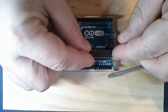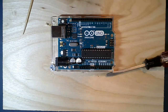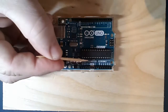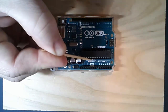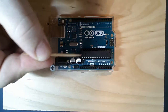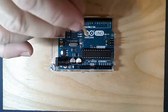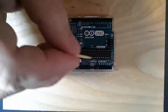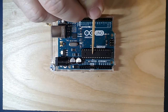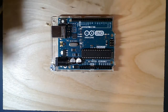Make sure power's off, line up the pins - there are tools that help you insert the chip - then push it in until it's seated. That's why we want the one with a DIP. You can also get Arduino Unos without the DIP - with a square chip surface mounted - and it's a little cheaper. But if that chip blows out, you're done and you'll throw away the board. Until you get your 'sea legs' and make your early mistakes, the Arduino Uno R3 is perfect because you can always replace the chip. Even after 30 years of experience I still make mistakes sometimes.